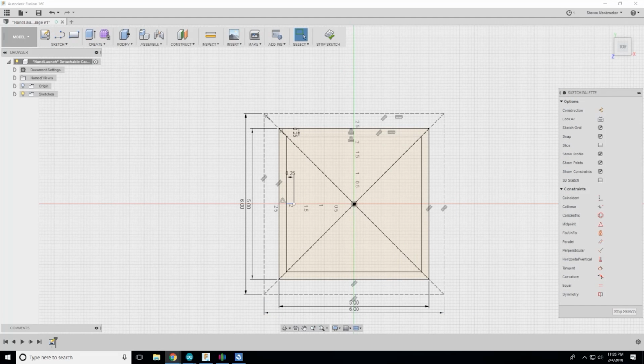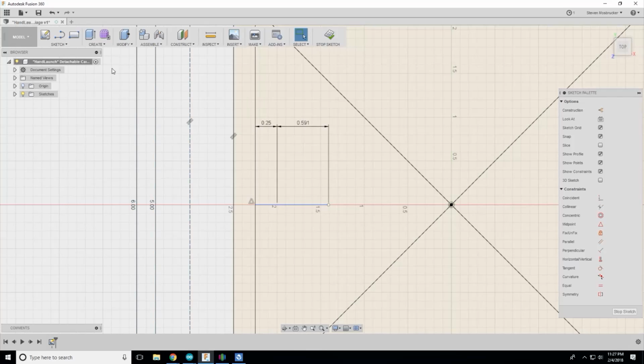We're going to look up 608 ZZ bearings and look at some of the details on those, some specs. And those are standard skateboard bearings. They have an 8mm bore, so that's a nice strong, it's a little bit over 1/4 inch shaft, which should be fine for pretty much all. This might be a little overkill, but they're very, very easy to get a hold of. 22mm outside diameter, so we need at least a 26 to 30mm diameter of whatever you put in here. So let's say from here to here we're going to do 15mm. So that would be the center of the box.